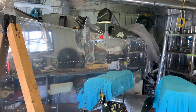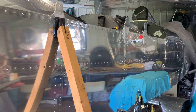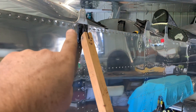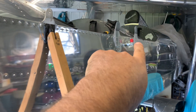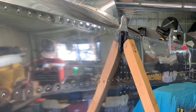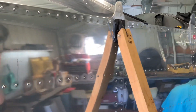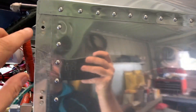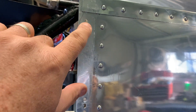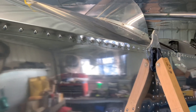A quick little overview. Pretty much all of the structure on Frankenstein is done with one-eighth dome rivets. There's a few 5/32 solids here and there, but everything else is one-eighth. The main reason was because I had more one-eighth Clicos than I had 3/32 Clicos, so that was a governing factor. I've used 3/32s in the anchor nuts, usually countersunk or dimpled.